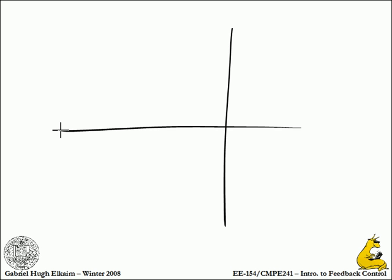Now, what we're going to start saying is, well, wait a minute, what if I have something that looks like, oh, I don't know, that. Here's my fairly complicated differential equation. And by the way, I have lost no information. I can go from this back to my differential equation. Actually, there's a little bit of information lost, but not much. From the transfer function, I can definitely do it. From here, I can almost do it. I'm missing a DC gain. With this and a DC gain, I have all the information I need to go all the way back to a differential equation. Ooh, that's a good problem.